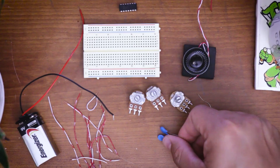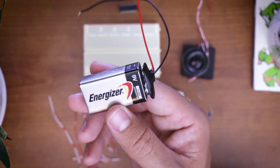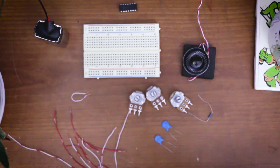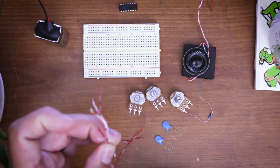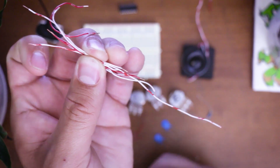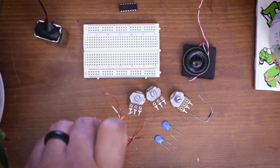You're also going to need some sort of power. You don't have to use a nine-volt battery, but I use a nine-volt battery and a nine-volt battery clip. And also just jumpers — a neat trick is if you have access to cross-connect wire, it's 26 gauge, works really great, it's solid conductor and is really easy to work with on the breadboard.